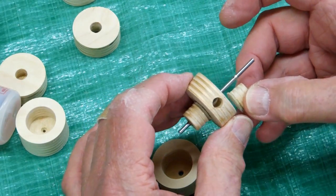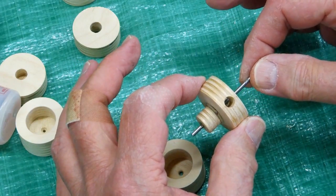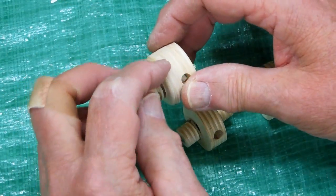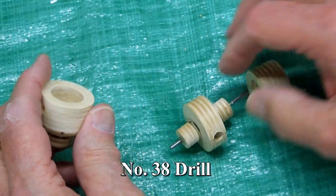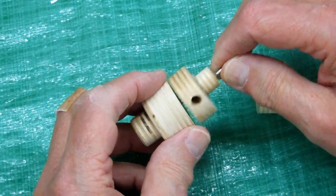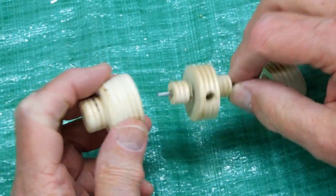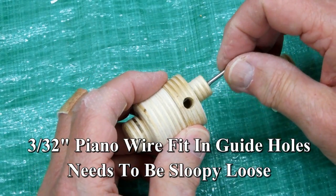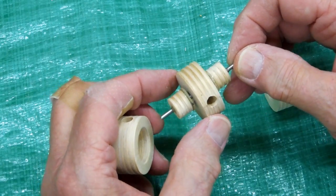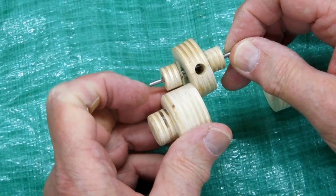This one will be installed here and works against this face, so it's opening one side and closing the other as it goes back and forth. This section was glued to the top and the hole is drilled about a quarter inch deep so this rod has somewhere to go. This piece keeps that sealed so there's no air leak. When we put this in here, we need to make sure both sides seal on the surface, and when this side comes up it's not yet touching the top of the three-quarter inch bore.